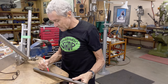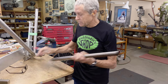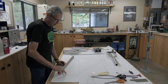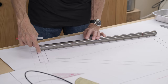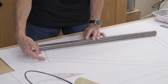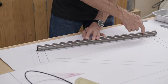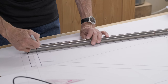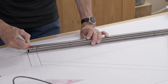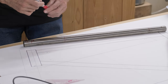So let's go over to the drawing. This is where the butts are — got the red felt pen mark. Let's look at how long the tube has to be and where we want the butt situated. Here's the top tube as drawn on the frame drawing. Up at the head tube there's a lot more force when you're riding, especially over rough terrain, so I like the butt to be longer there. Then we have a really short butt down here. This is the miter line — I put an M there. And then we want a hacksaw line, HS for hacksaw. So we're going to cut it, miter it. The angle is quite small: 7 degrees.